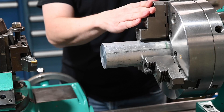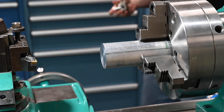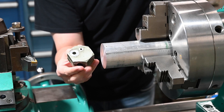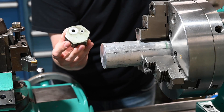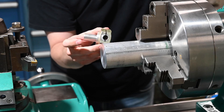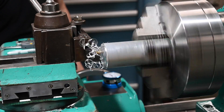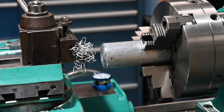I've got the chuck changed over and we've got our aluminum stock for making the hardest part of this adventure, which is the turret that the drill carriage sits on. This is two-and-a-half-inch stock. We're just going to make it round instead of hex because there's no need for it to be hex. We'll go down to two inches at the max diameter, then three-quarter, and then three-quarter down to here. Let's bump up that feed — that's going to take the rest of my life otherwise.